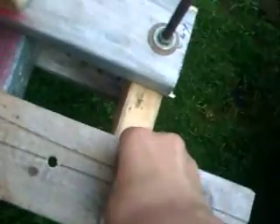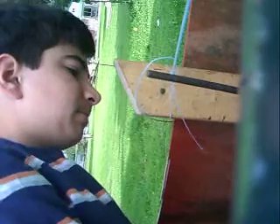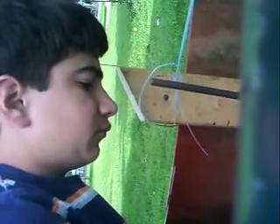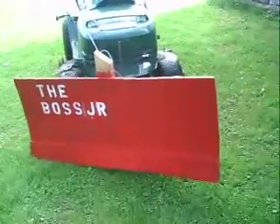What you do is you take out this bolt — if I can get her out. The right wing. Then you can lock this in, just like that. Setting that bolt in the preset holes, and the blade will actually be able to plow at an angle.